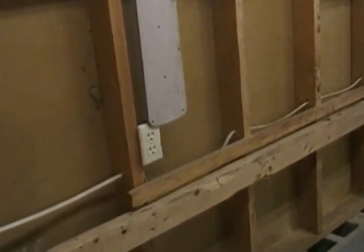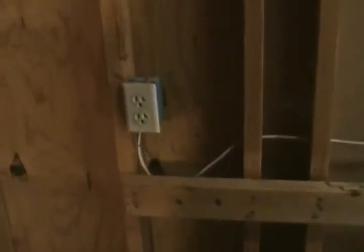All of that has run off of the back wall circuit. Over here, this is my right wall circuit. I've actually got four different circuits in this garage, and one of them I haven't quite figured out if there's anything going to it yet. I may find that out when I get everything moved off the left wall. But over here we're gonna do the same thing — come up here, put in a little box, put a light switch in it, run up through the top plate, and come over here on one of the trusses and run the wire to it, put it inside a box for now until I figure out where I want to run my lights.